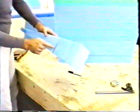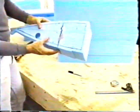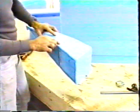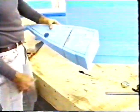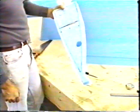When we cut this, this is going to come apart here in some areas. We don't have a full bond in this area. When you do your glassing, you'll backfill unintentionally with resin that'll run down in here and finish the integrity of this bond. It's already far beyond the level of bonding that it actually needs to be. And we'll get to the bandsaw now.